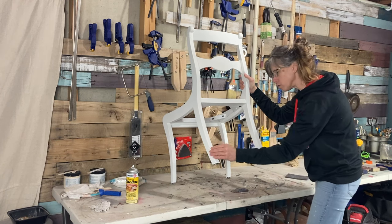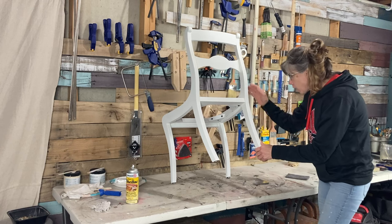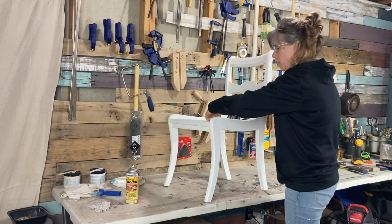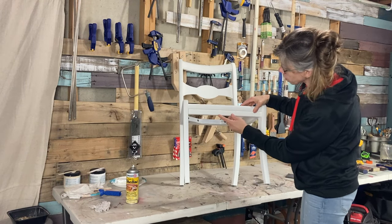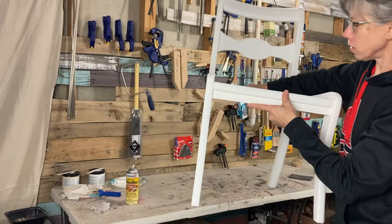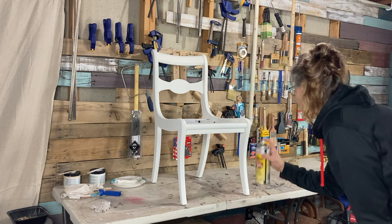So I'm trying to go through and just rectify any little bits of dust or bristle brush, whatnot, and at the same time making sure there's no bleed through, because I was also taking off pieces here and there in that last coat, which would expose back down to the wood in some cases. Like here, there's a little dot of bleed through where I had to remove a chunk of debris, and then it brought the wood surface back enough to where the primer wasn't on it anymore.